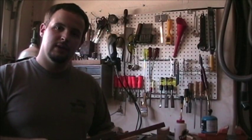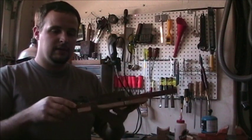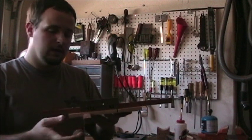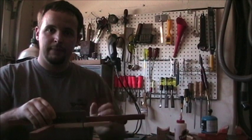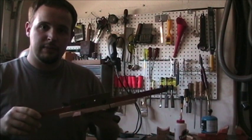Hi, welcome to Six Gun Guitars Luthier Lessons Video Series. In this one we are going to talk about the Kerfing Jig. This is a little jig that is used on a slide in the miter slot of the bandsaw, so that way you can slide it in and out with a piece of kerfing blank in front of it, and it will slot even kerfing all the way along whatever length of strip that you desire.